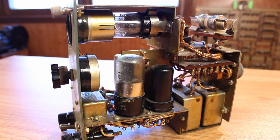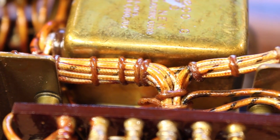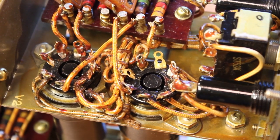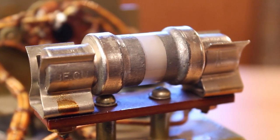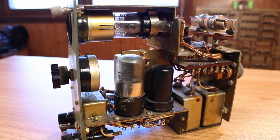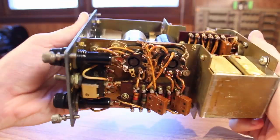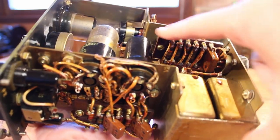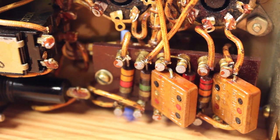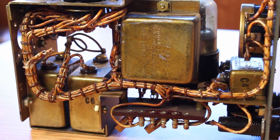It's kind of an overkill rating because near as I can tell this thing runs on rectified 120 volts, so it's only going to have at most 180 volts anywhere on the circuit. But as we'll see, it is incredibly over-engineered. All of the wiring has beautiful wire wrapping on it and everything in here is coated with a conformal coating. On the back we have this really wild-looking component, but it turns out it's just an incredibly high-wattage 500 ohm resistor, which sits in the heater circuit for the four tubes. There are quite a few passive components on turret boards — one right up here and another on the bottom — and everything is wired up with point-to-point wiring. You can get a really good look at the beautiful job they did routing the harness.